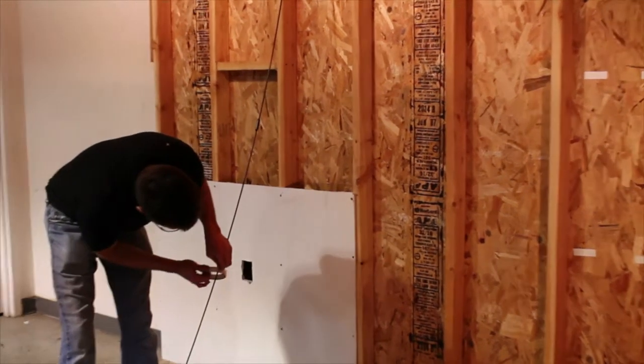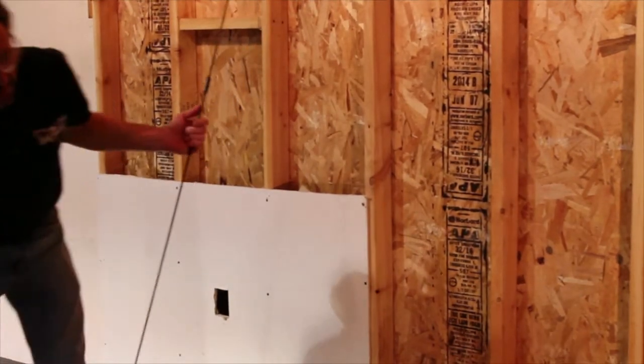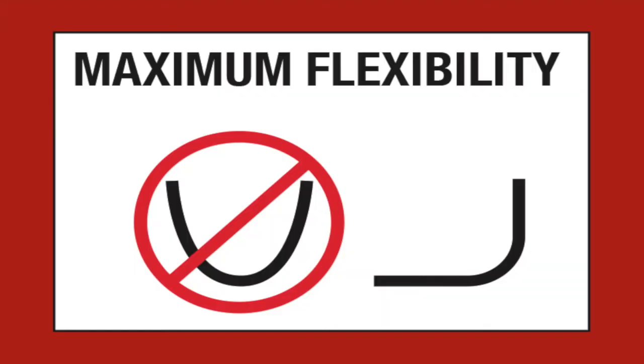And rafters are not always directly above the wall studs. If this is an insulated wall, make a cut in the insulation at your opening and make sure you get the drill bit completely through the insulation and into the back corner before starting your power drill. Keep in mind that these bits are not indestructible, so try and keep your power drill as close to the floor as possible. This will keep the bit from arching too much.